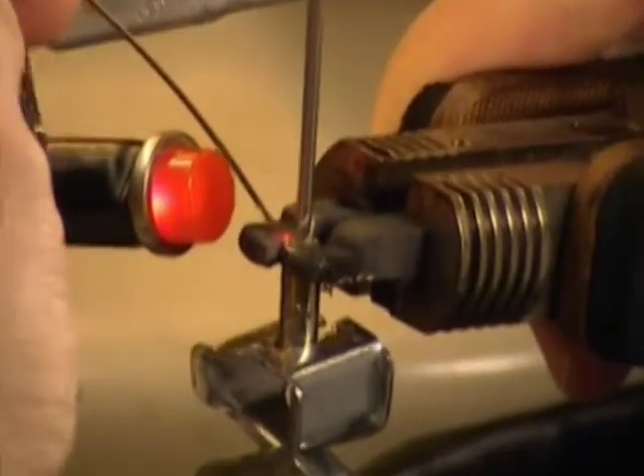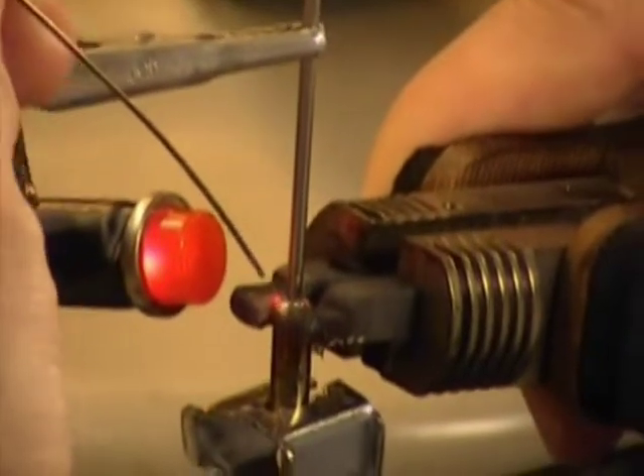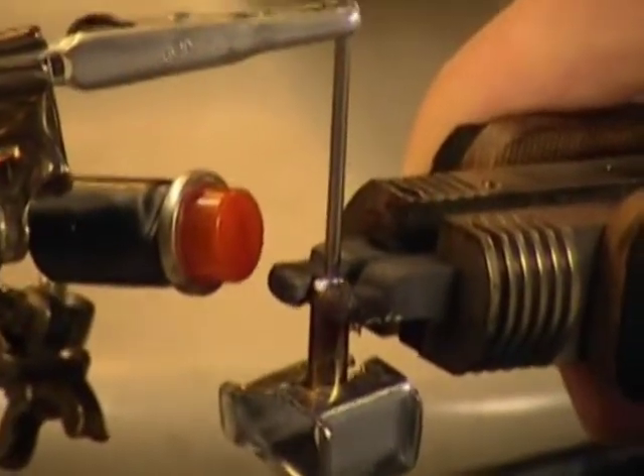Here we have a smaller stainless steel tube with a special connector that are being brazed together to create a capillary tube assembly. We are using braze wire with a melt temperature of about 1200 degrees Fahrenheit.